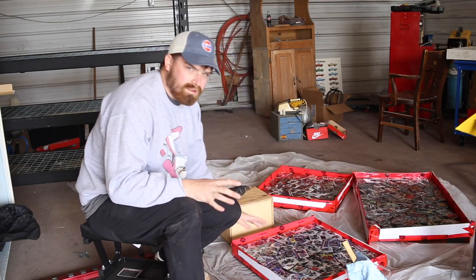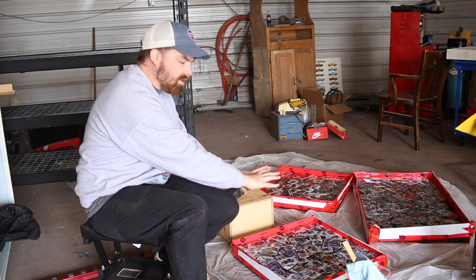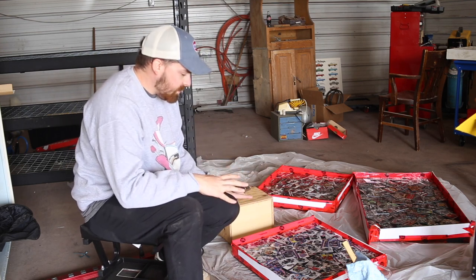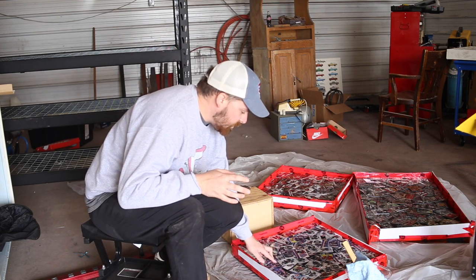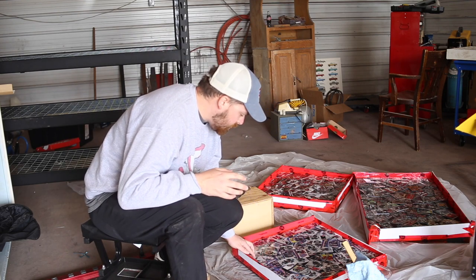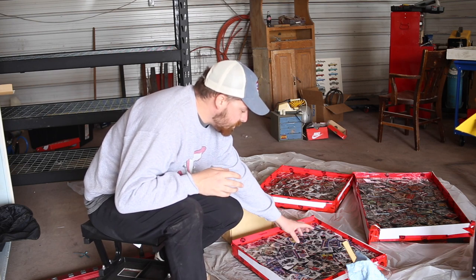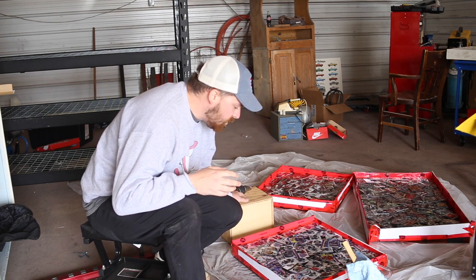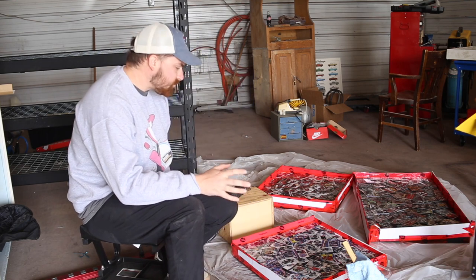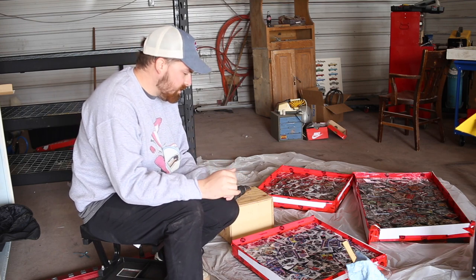So with epoxy, the first layer, they call it the sealant layer, because you're kind of sealing everything down. The second layer is the main layer with the most epoxy, and that sets what it'll look like. Then the third layer, you're going in and filling the holes that you have, like around the edges, or I get some wavy stuff here, because I probably burnt it a bit too much. Between the second and third layer, I like to give it a lot of time, but I don't know if you should.